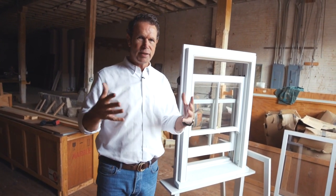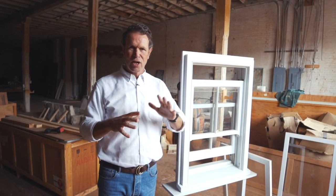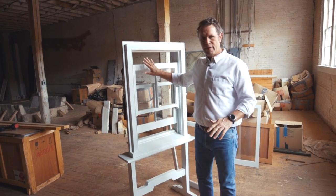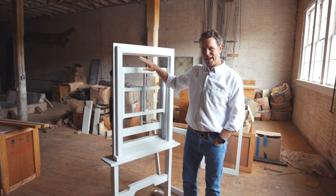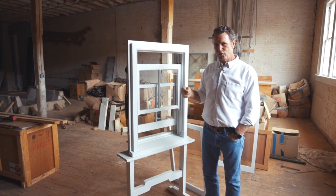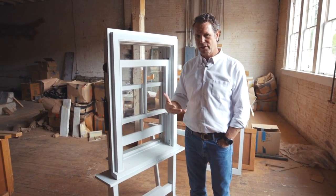In the late 1800s, 1890s, turn of the century, that desire for fresh air — the shingle houses on the west coast, east coast — all got built because people desired this kind of fresh air system. I love it from that perspective. Especially here in Texas, they're going to talk about insulating. The energy value that these windows get is actually pretty awesome. When we've had our windows tested in a window testing lab, they grade to a grade 40 window, which is a real high quality window — when they're weather stripped properly, when they're new, when they're fitted properly. This is a very well-designed, long-lasting window.